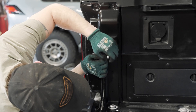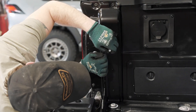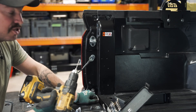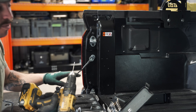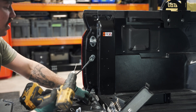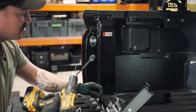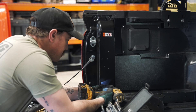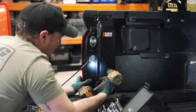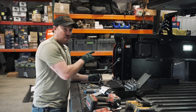When drilling, I'm going to start with an eighth-inch bit. We want to start with a smaller bit and work our way up to three-eighths of an inch — that'll be our final hole size. I'm going to start at the bottom and work my way up, and we'll also work our way up with bit size as well.